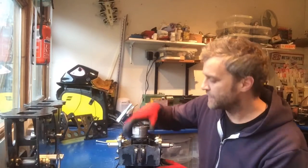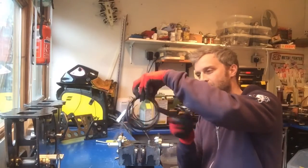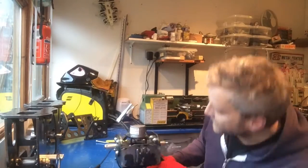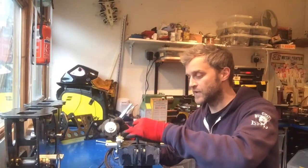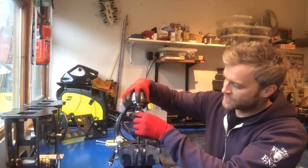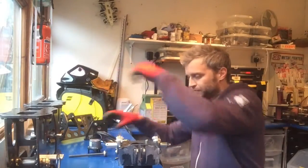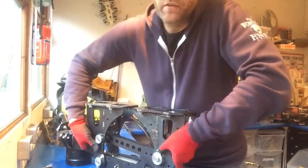That would bolt on here. When I take this back off I've got to countersink the other side so I can bolt through to the standoffs on the encoder mount - I can't do that right now as I don't have my countersink drill here. I made this shaft up which should be roughly the right length - it passes through from the front of the encoder off the gripper head and attaches to the encoder. The whole thing bolts through here so you end up with a shaft coming through the center of the rotary axis.